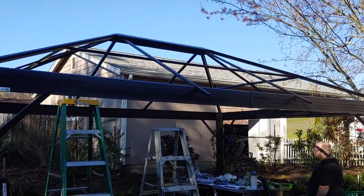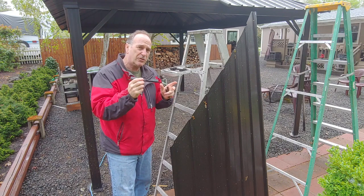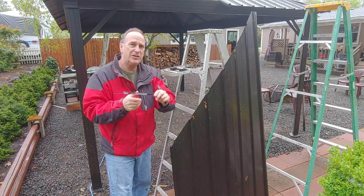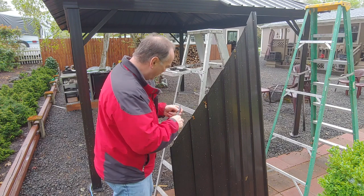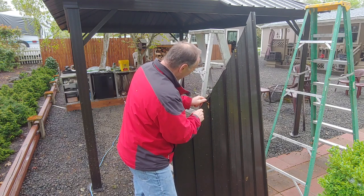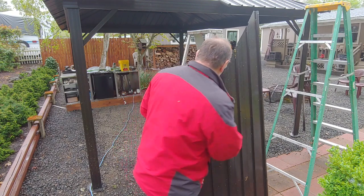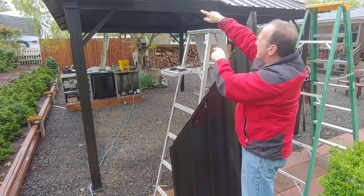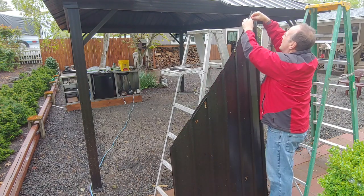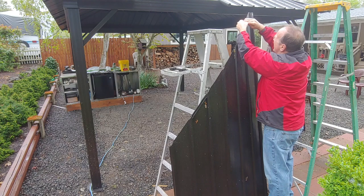We've got all our roof frame up with the cross members on. We're ready to put the metal on — put the pedal to the metal. First I'm going to put on these rain guards. The instructions get a little confusing here because the pictures show a condensed dimension. These rain guards slip in just like this between every ridge, then go up into that ridge and stop the rain. You have the big rain guards, and up top where it's set up a little bit there's already a rain guard, plus a little rain guard that goes in there too.